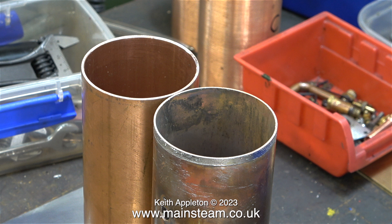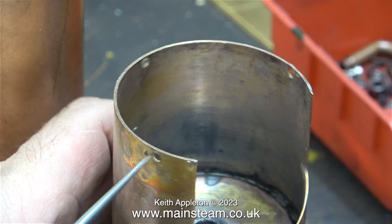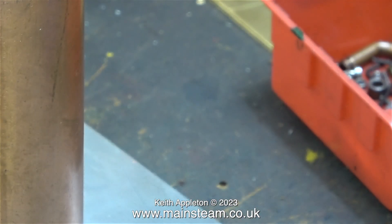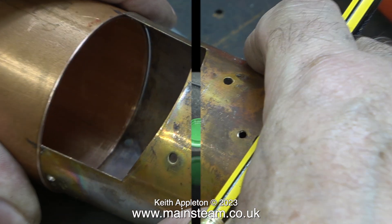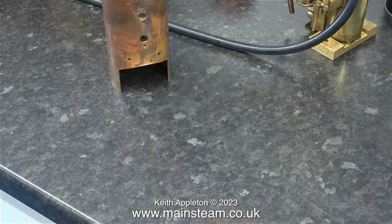When I make this new boiler, for the top cap and tube plate I'm going to use gun metal, not brass, and the centre flue will be slightly thicker copper tube. What I will have to do is transfer the hole positions from the old boiler barrel to the new one, and also duplicate the shape of the cutout where the burner goes. I could do it by marking the positions with a pencil, but I have a far simpler idea which involves a piece of paper and some sellotape — I'll show that in the next episode.